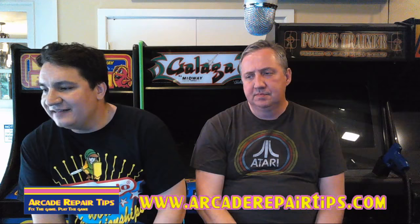Let's see what else we have here. You can use a JPAC to hook it up. Now, the only thing is the JPAC doesn't convert the signal, Tim. Correct. So you can use it to hook it up, but you still have to have something that's going to convert the signal. Right, and that's the kicker. The JPAC will amplify the video signal so that it works. But that's why you also use an arcade VGA, because the arcade VGA converts the signal. Unfortunately, you can't use an arcade VGA with a Raspberry Pi. There's nowhere to put it, right? Right. So you still need something that's going to convert the signal for you in order to hook it up to a CRT.